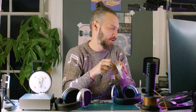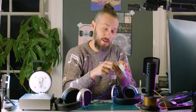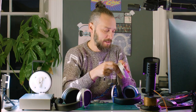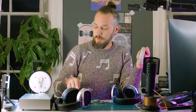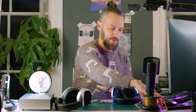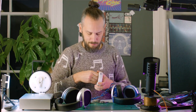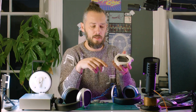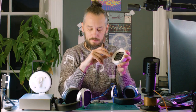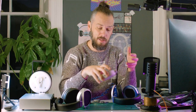I'll stick some links to where you can get some, but obviously this is a pretty standard thing, just eBay, Amazon it. You'll want 4 or 5 per ear cup, so get a pack of 10, just in case. I've got 5 holes on the ear cup, I'm only using 4 of them, but again, it's down to personal taste if you want an extra one. So then you will have the whole thing sandwiched together, and when it's built properly, you will end up with a ridge around the outside, which will take a standard pad of around 90-100 mil. The biodynamic pads will go on there, and anything that will fit a biodynamic will fit these.